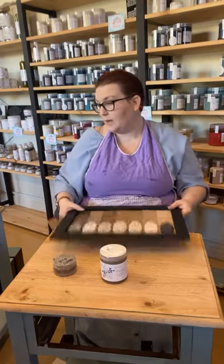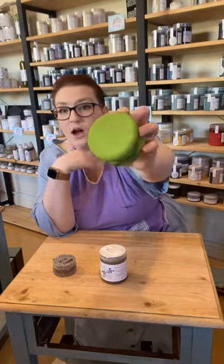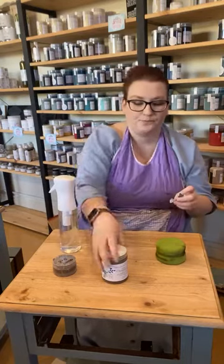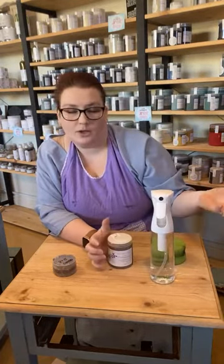To apply my stain, I use these sponge applicators. I don't really use a brush at all unless my timber's really rough. For most furniture, by the time you finish sanding it's going to be really smooth, so I use a sponge applicator — I find I get a much nicer finish with no brush strokes. I also use a Mr. Bottle spray bottle. If you've got a spray bottle, use a spray bottle. I really, really like the little bit more control they give me.